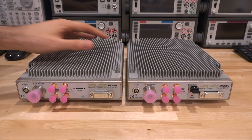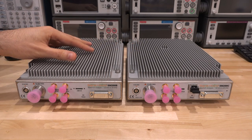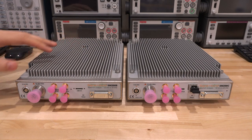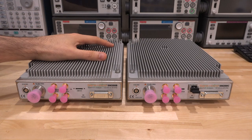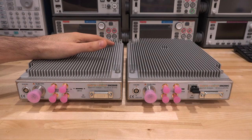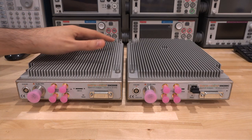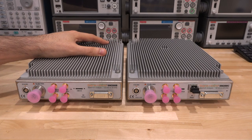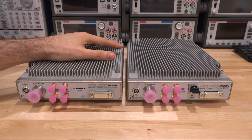It's hard to find anything wrong from a mechanical standpoint. My only complaint is there's no power switch — soft or hard — so the only way to turn them off is to unplug them. For bench use that's a little inconvenient, but for field use you plug them in and leave them, since they have OCXOs and GPS-disciplined OCXOs that you don't want powering on and off repeatedly.